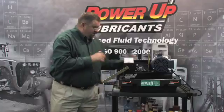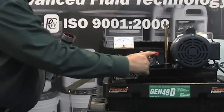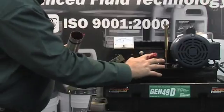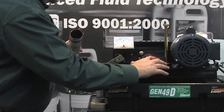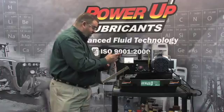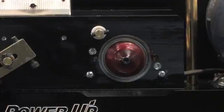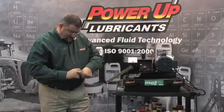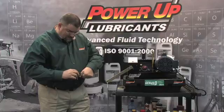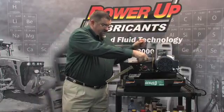Now what I'm going to do is take this grease and we're going to cover the race. I'm going to be very generous. We've got that race completely covered with grease. I want you to notice that I've got grease all the way around the race and even in the center here — this is kind of how we test pressure and drip point. Now we're going to turn our roller bearing to a new spot. We've already seized up the bearing, so we're going to turn it to a new spot. Before we do that, let's take a look at the spot that we had, so we have something to compare to.